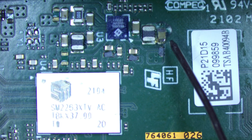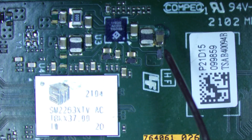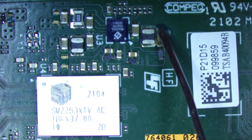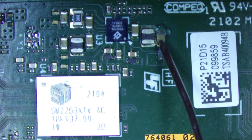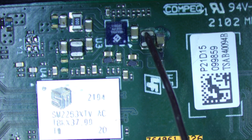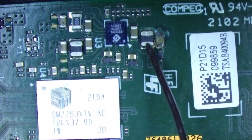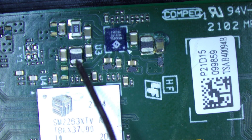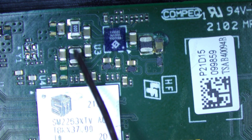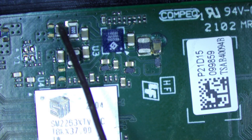That red glowing spot is a capacitor that has gone short to ground — this capacitor here that glowed up with heat. It looks very nasty, like it's been discharging. We'll probe both sides of it: it's shorted to ground, definitely causing a problem. It looks like it's there to decouple or smooth out this inductor here, and it's put that side short to ground. The inductor on the other side is not shorted, so I'll remove it and see if that clears the short.